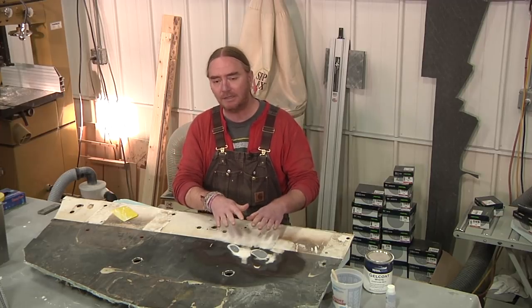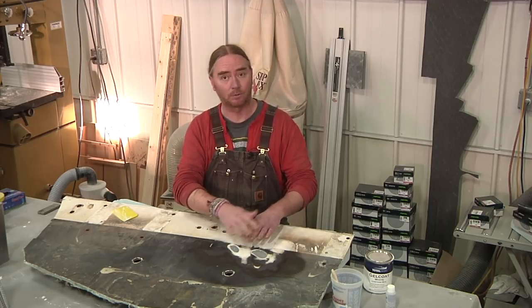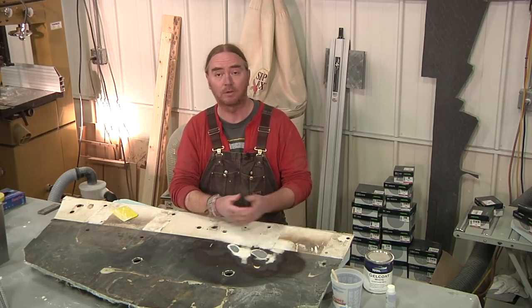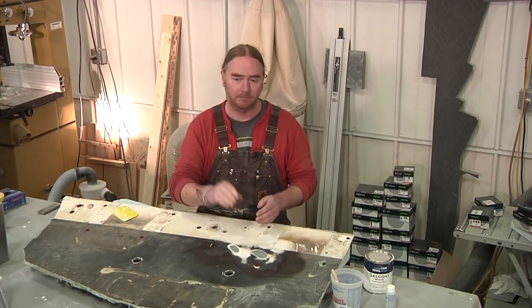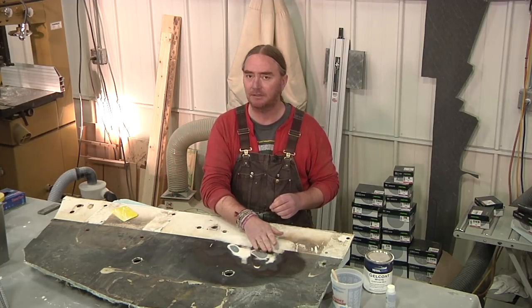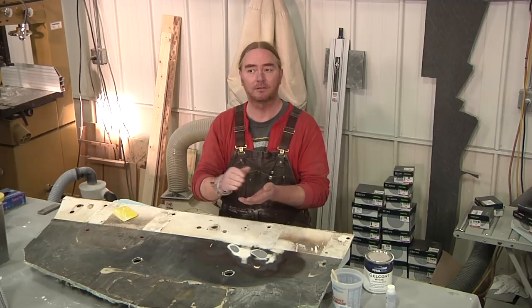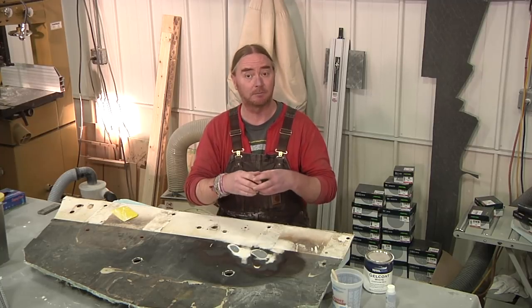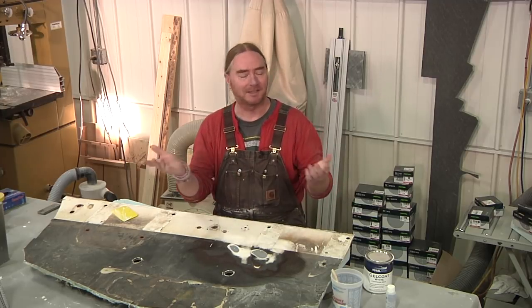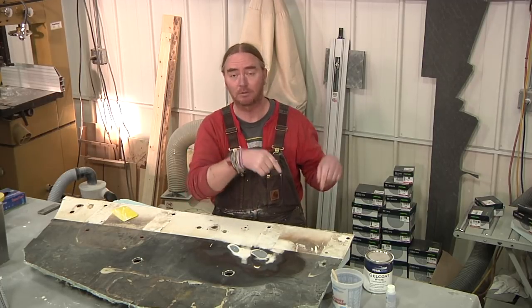But if we're going to be looking at doing gel coat on something like this, because I use polyester resin for polyester-based materials for all the stages of the repair, I would be 100% able to use Gelcoat on here. The only thing that I would do is, because Gelcoat is a little bit of a thicker material, you would need to sand a little bit of a dip in here, roughly about a 16th of an inch low, because that's going to account for the gel coat that you would then be applying and then sanding flush and then buffing that out. I've done videos on gel coat color matching and application and finishing and all that other good stuff. And again, I'll put those links down below in the description.